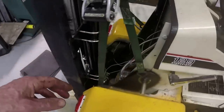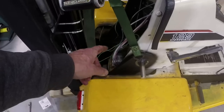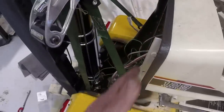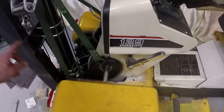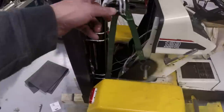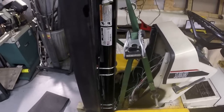After that, we're going to shift our focus to the hydraulic system. Got hoses from the hydraulic pump going to come up to a valve. We'll put a backing plate across behind the dash here, and we'll have the valve over here on the right-hand side with two levers, one for tilt, one for lift. Hopefully the tilt cylinders will be here, and we can get them installed on both sides, and should be getting a working lift here in the next week or so.